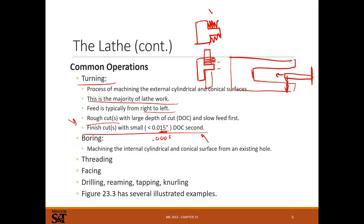Boring sucks and I highly recommend not doing it unless you absolutely have to. Boring bars usually have a high aspect ratio - a lot longer than their diameter. Anything more than about three to one, you have to be very careful about tool deflection and vibrations, and getting a good surface finish becomes more difficult. You can't be very aggressive with a large aspect ratio boring bar. So when you design parts, you should always try to design parts that don't need to be bored.